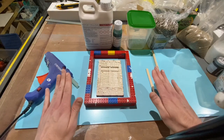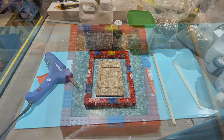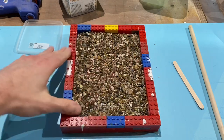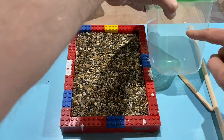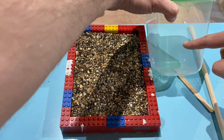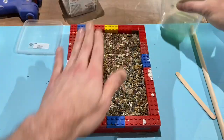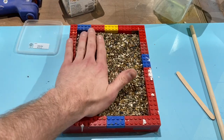I've made sure that my work surface is nice and flat - I've used a spirit level to make sure the rubber's not going to run to one side. I've shimmed up under the legs, so we should be in a good spot to get a nice flat bottom to the mould, so that when it's upside down and you're casting it you get perfectly even thickness bricks. Here I have the mould glued round the edges, nicely fixed in place, and I've filled it to a suitable depth with the gravel. When the glue is fully cooled down, I will tip the gravel into this container which I plan to mix the silicone in, and I'll see how far up the container it comes. I will mark that with a sharpie, then tip the gravel back into its pot and bag, and when I put the silicone in I'll fill it up to that line on a set of scales. Then I'll add the 10% catalyst which will come up a little bit more.